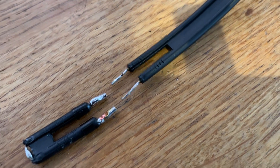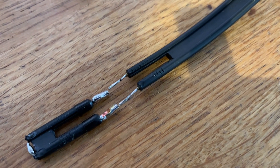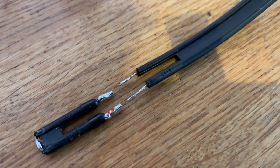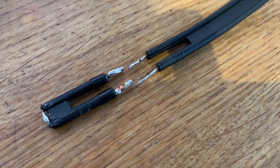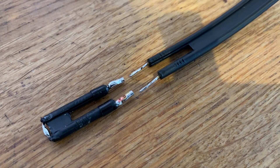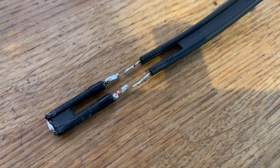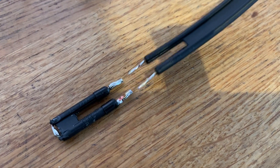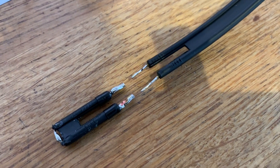Now, at the bottom of the slim jim, you have to connect your coax cable to it an inch and a quarter above the bottom join. So to make my life easier, what I've done is I've actually cut the window line and made a matching section for the bottom. And I'll show you why I've done that now.